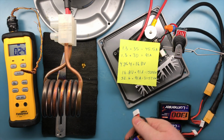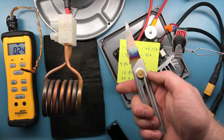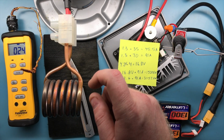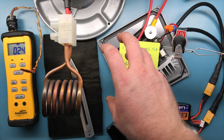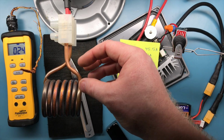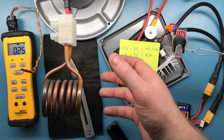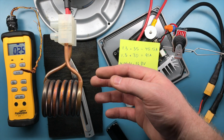Now they're not meant for being used for long periods of time, but for quickly heating up a blade or loosening a nut in the field. If you look up "bolt buster," you'll see it's a little portable induction heater, and it's used to loosen up seized bolts. What it does is, when you heat up the nut, it becomes cherry red and expands and contracts, which ends up loosening the nut, and you could take it off.